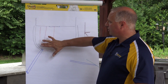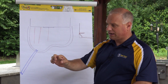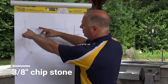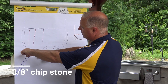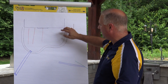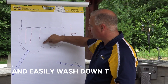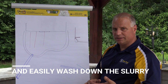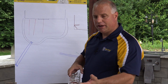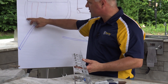Back to laying — screed rails, we're going to screed out number 8 stone, your 8 or 9, that's your three-eighths chip stone. Lay your screed rails, take our screeder, screed this out, then lay your pavers. Once all the pavers are laid, we take our saw and cut around the whole outside edge. Then we install our edging — the hybrid edging. A major problem in our industry has been not having a simple solution for edging on the outside.